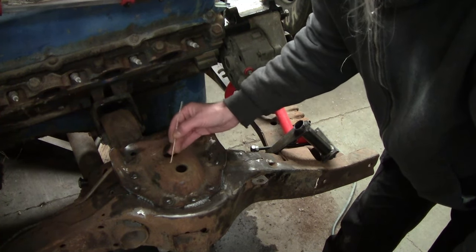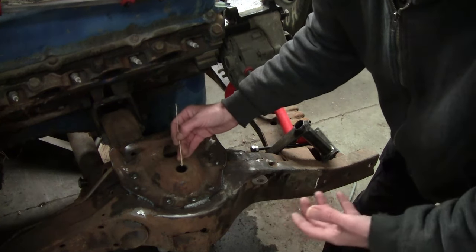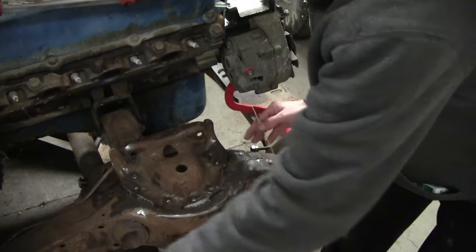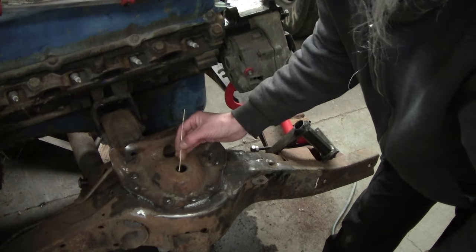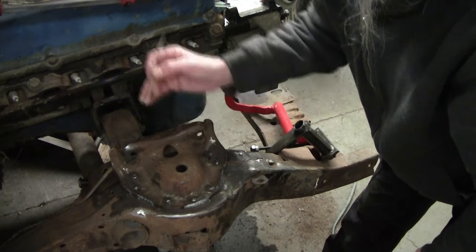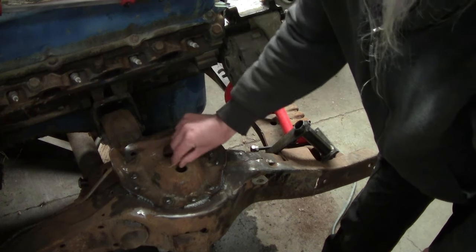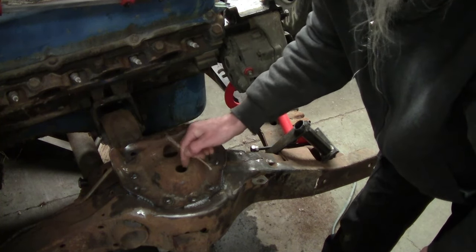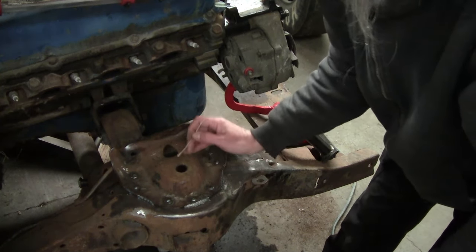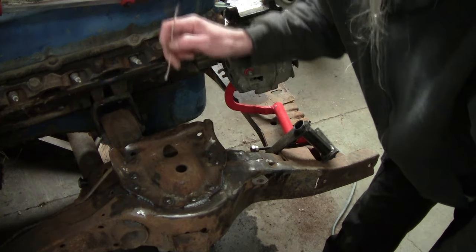Start there, start there, start there, and sheet metal especially, because you don't want to just lay into it. You'll burn holes in and warp material. So you light it, you light it, you light it, you light it. Now you got those tacks going around like that, almost filling the hole, and then right in the center, just like with your plug weld, you hit it. And then you roll it around like that into the center and do a hard hit.